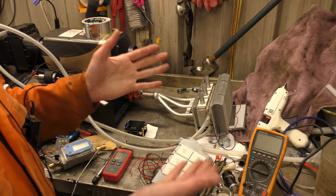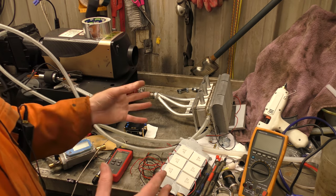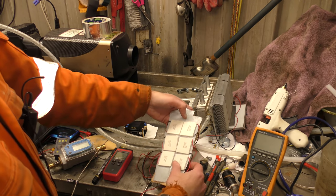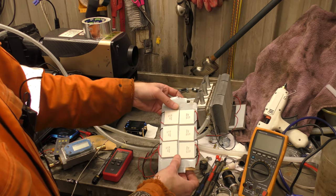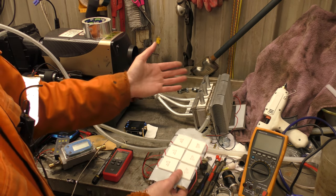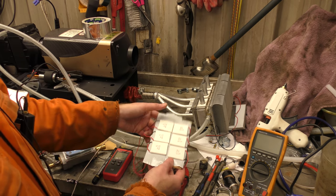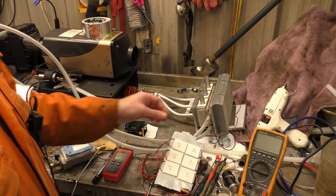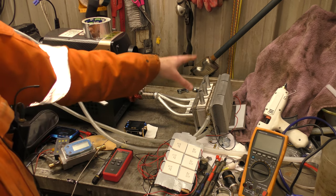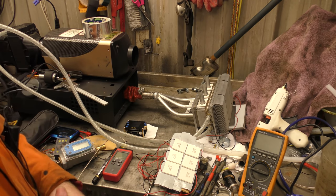And let's see what we get using cheap TEGs and cheap parts and see if we get any different, better or worse results than the really expensive ones, especially if we're dividing up pound for pound. Six, seven, so that's like £42 worth of TEGs as opposed to £300 worth. Should we do a sort of volt per pound, or pound per amp, per watt? We could do per watt. So we got 1.5 watts for £300. How many watts can we get for like £50? Then that'll be interesting to see.